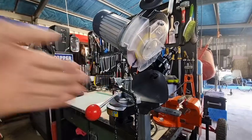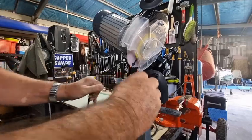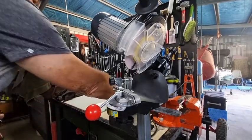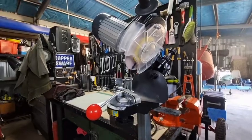Now this is the chain that we used. I cut up some other timber off and on for about three hours until I felt it was reasonably blunt — it was taking like 20 seconds to get through the logs, so that's blunt. What I did, and we'll show that, is I set the grinding wheel so that it only ground the top plate and not the side plate. Hopefully we can get in there and have a look at that.